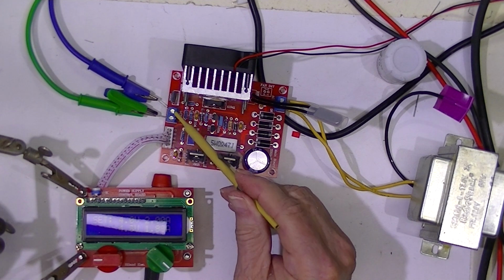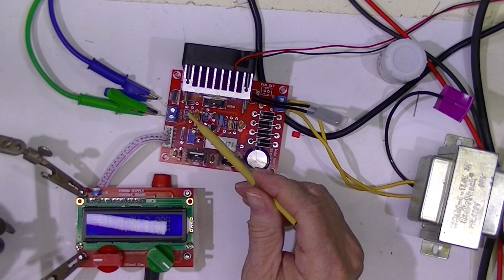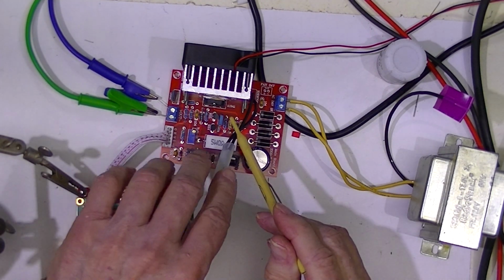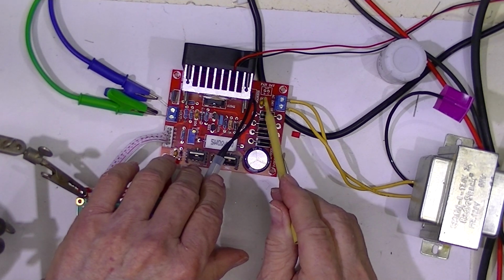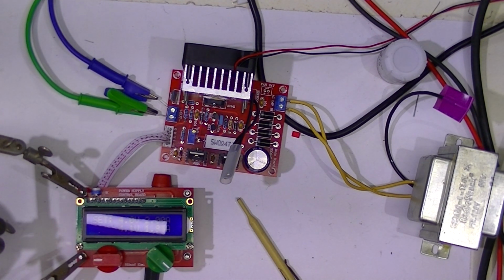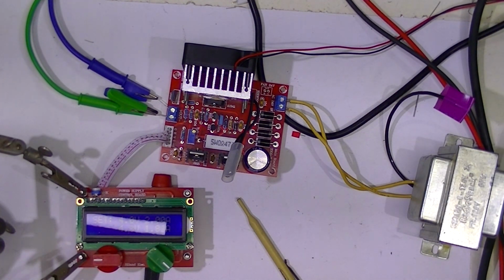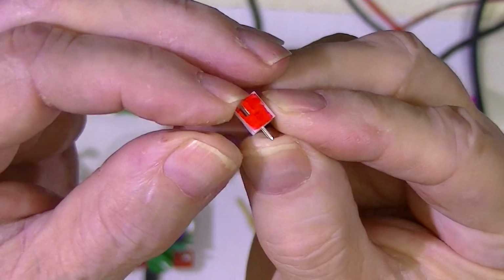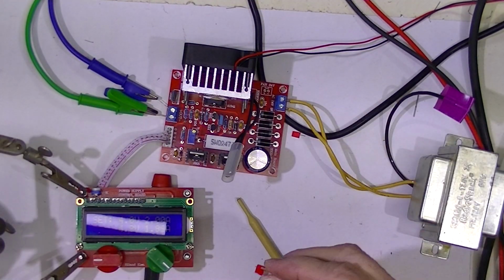Now the screw terminal comprises the output voltage. Once you solder it in place, you can still read the plus and minus. The fan, however, once I solder that socket in place, it obscures the plus and minus markings. So I've lost the fan markings. So I've taken the option of painting the positive side of the fan jack red, because once I plug it in, once I secure it to the board, it will be unreadable.